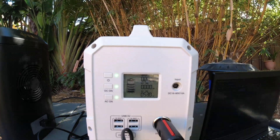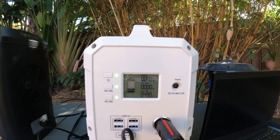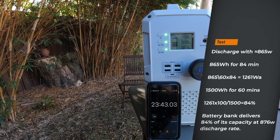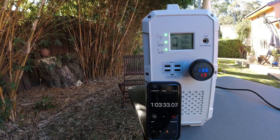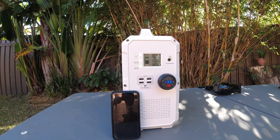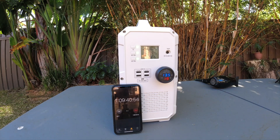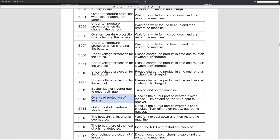I won't bore you with the full details of every test I did, but if you are interested please let me know in the comment section and maybe I'll make a separate video. I pretty much tested everything besides the low temperature charge protection and operation above 40 degrees. In one test I used a hairdryer which used around 860 watts and the EB150 shut down after around 87 minutes. So my unit could provide around 83% of the advertised 1500 watt hours of power, which is around 1245 watt hours or 81 amp hours. The unit had no problem providing around 900 watts continuously and did provide 1200 watts for a second before shutting down with error code E013 — overload protection of inverter — when I used my heat gun on the hot setting.